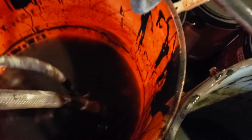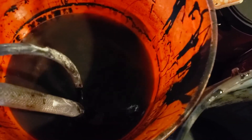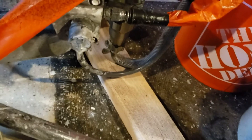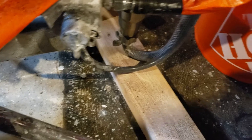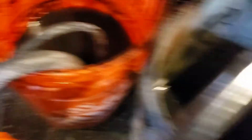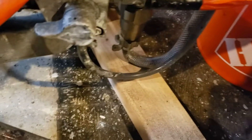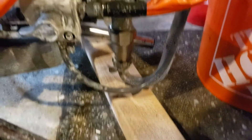These two tubes will click together — it clicks on right there to the big tube, the waste tube. For practical purposes I'm just going to stick them both in the paint bucket. Then we want to take that purge button and make sure it's pointing to the left or the right. The purge button has been turned to the left or the right. Then we want to take our spray gun — let me go grab the spray gun.